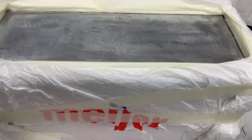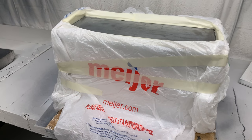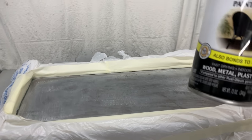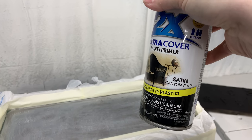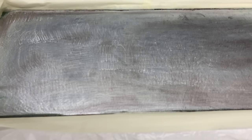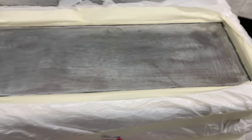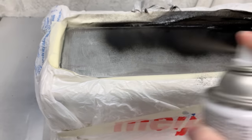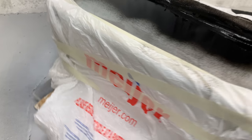Unfortunately, it would have been nice to leave the top as metal, but metal doesn't sand very well — it shows all the marks of the sandpaper. So I'm going in with the Rust-Oleum paint and primer. We accidentally picked up the satin finish, and the knob I picked out for it is kind of shiny, so here we go — a God wink moment to use this satin finish up. I wrapped this bread box in grocery sacks and taped it off because spray paint finds its lowest part just like water and will find any gap or crack to get through. So make sure you thoroughly tape off and protect anything you've already painted before going back in with spray paint.